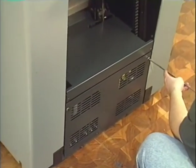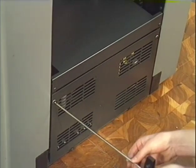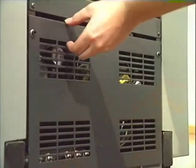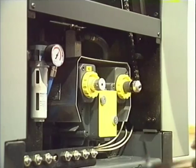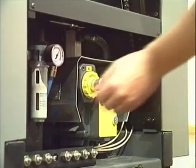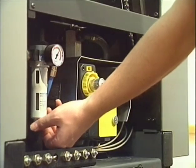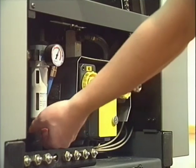The compressor is underneath the feeder and is accessible after removing the guard. The operating pressure has been preset at the factory so that the pointer of the manometer is in the green area of the scale. When loosening the screw at the glass bulb, you can drain the condensation water. Please tighten the screw again.